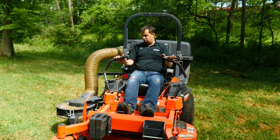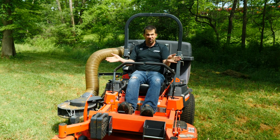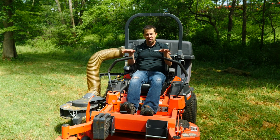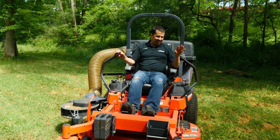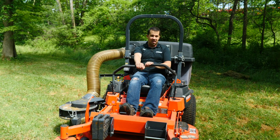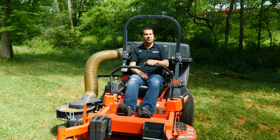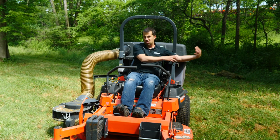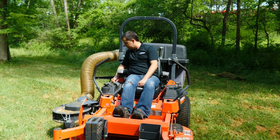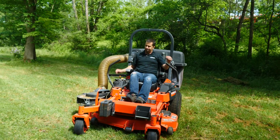Mechanically, when you're running a zero-turn mower, each one of these sticks has complete independent control over your left and your right side tire with no talking back and forth at all. So what you need to watch when you're going through your turns is that you're keeping the tires moving, right? If you have, say, one side of the machine driving with the other side still, it will pull that tire along and do what's called turfing. Basically grab the grass and drag it along with the tire, doing damage. There's a couple of different ways that you can run the machine to avoid causing that to happen.